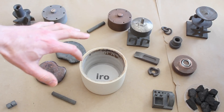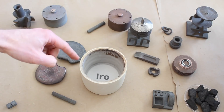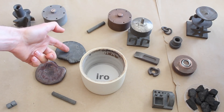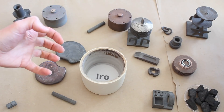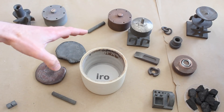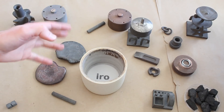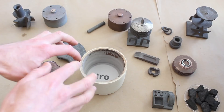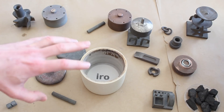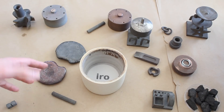The way it works is that iron powder itself never melts — the kiln temperature is not enough to melt the iron. But there is a phenomenon where carbon from the filler metal can diffuse into solid iron at reasonably high temperature, at the temperature of the kiln. So when you hold it at, say, 1250°C for about 2-3 hours, the carbon migrates from the liquid filler metal into the solid iron powder, and the carbon content somewhat equalizes, so you end up with a somewhat uniform carbon content in the part.